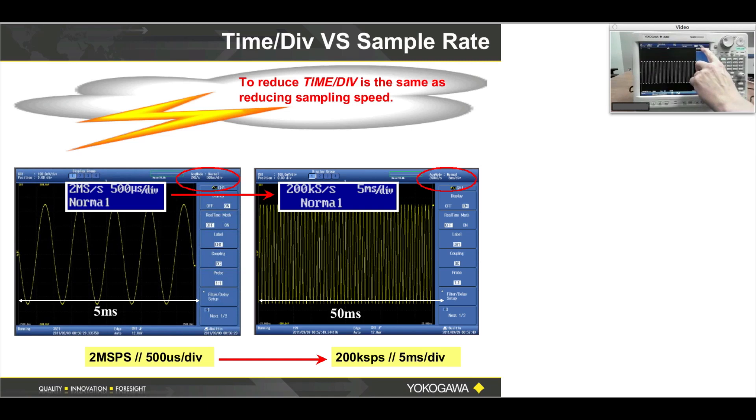There are three things I'd like you to closely examine on the screen. One is main — it says 10,000. Main means the main window, the main time domain window. So main 10K means 10,000 points across the screen — that is your record length. You'll also see the sample rate: 500 KS/s, kilo samples per second. And you'll see the time per division — I'm at 2 milliseconds per division, which multiplied by 10 divisions equals 20 milliseconds total.